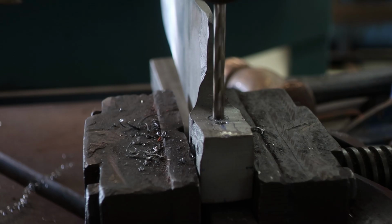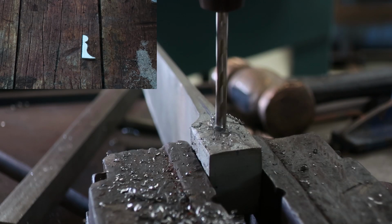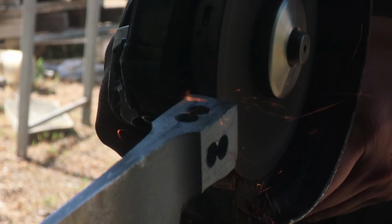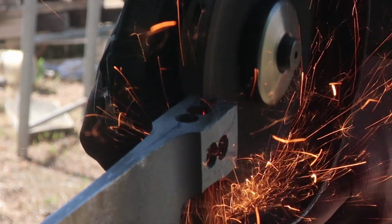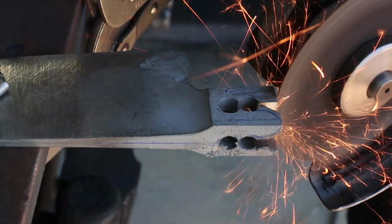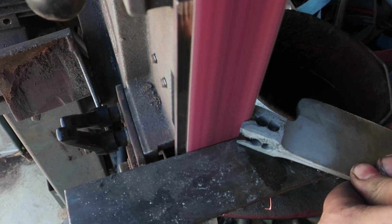The way I marked out the keyhole is by drawing half the template of the design I wanted, which is the area that would be in the negative space. After that, I placed that on an aluminium sheet, then mirrored it to create an overall profile, then inscribed it. I then cut out the middle, leaving the outside profile, and laid that on a bolster, making sure it was in the exact same position on both sides by the use of center lines, and then marked that.